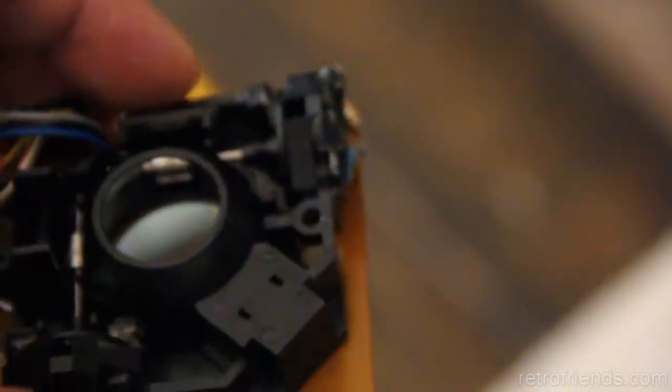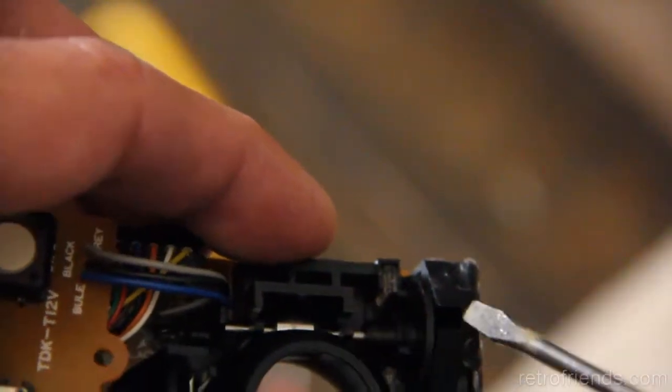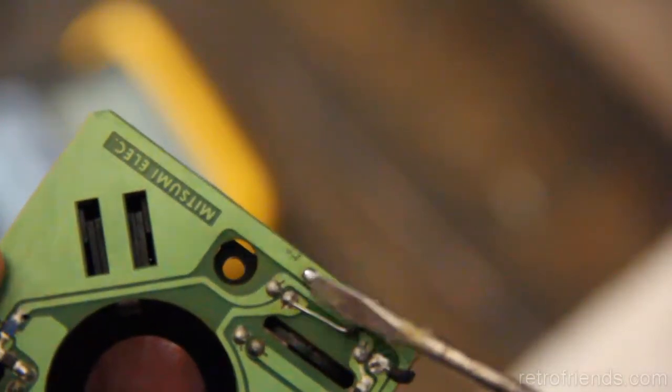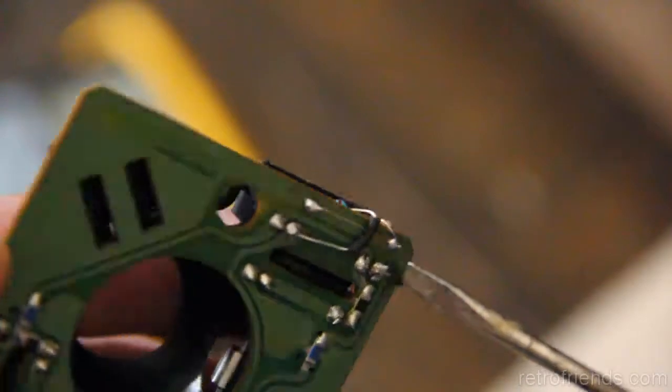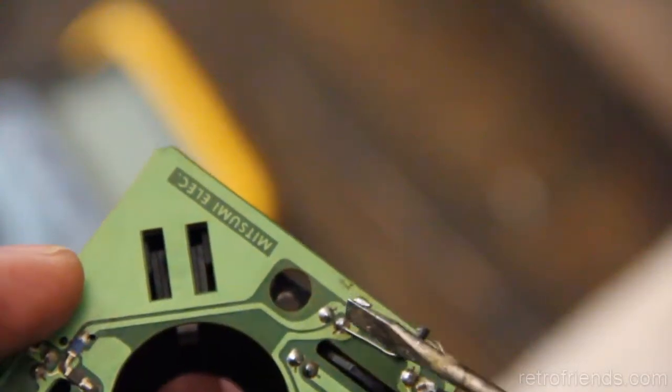So once I sorted that, and basically the reason why I figured out my mistake is because I've had that problem with mice before, and I just couldn't remember what it was I did to fix it. And sure enough, it was something about how loose this shaft is. It needs to be very stable so that it doesn't wiggle very much. So anyway, now it's a fully functioning mouse. I probably could have put the 1.5 resistor back here, but what's the point? It looks pretty good the way it is. It's reliable. I'm already going to have a resistor here. The only other alternative would be to get a couple of SMD resistors and put them in place, but I'm not going to worry about that. Somebody who looks at this is going to know somebody did a repair. So the mouse is now fully functional.